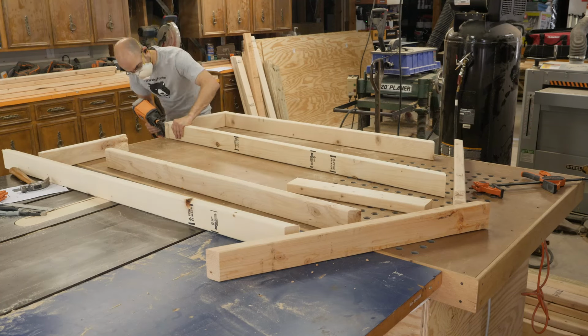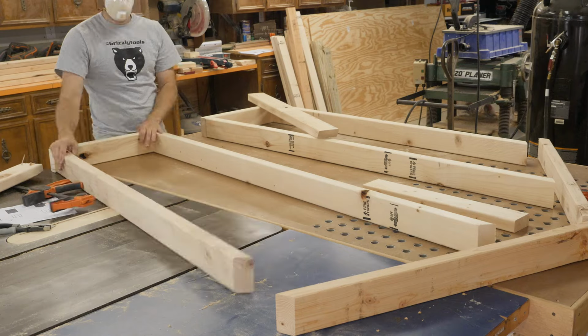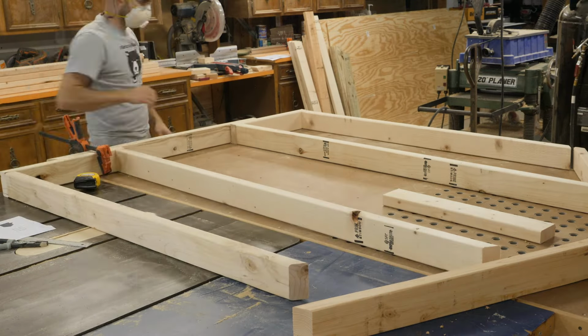This wall will eventually have the entry door installed in it, and as you see, the base plate is not one continuous piece across the bottom. So to make these 2 surfaces coplanar, I used a scrap 2x4. I clamped it to the bottom of each base plate and then went about framing out the rest of this wall.